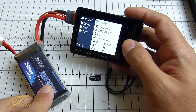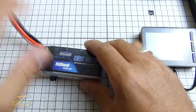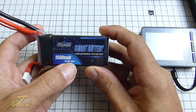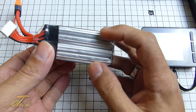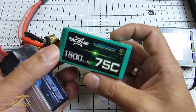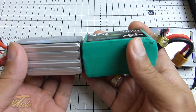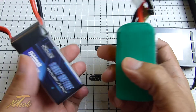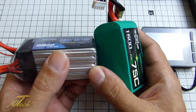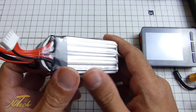So there's a quick look at the whole Battery Go thing. Really liking that. In terms of the cells and how good they are, I've yet to test that — I'm going to have to go out and fly these. They seem to be about the right weight for a 1500 milliamp boasting an 80C discharge. If you ever see a 1500 milliamp 80 or 90C discharge and it's suspiciously light, the cell density — if these cells are thin — that's a red flag. Here's another one of my favourites, a 75C AC 1500 milliamp — great, really high current handling, very similar size. That cell density is always really indicative of a good high-C cell from a manufacturer that's actually telling the truth about their C ratings. If it doesn't weigh anything, chances are they're lying, and it may be good for the first 10 cycles but will quickly degrade.